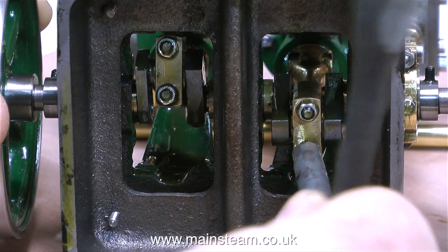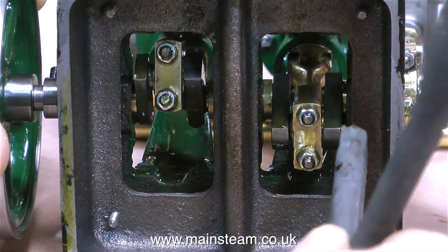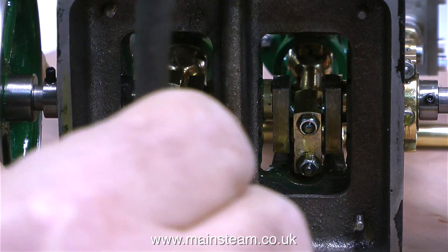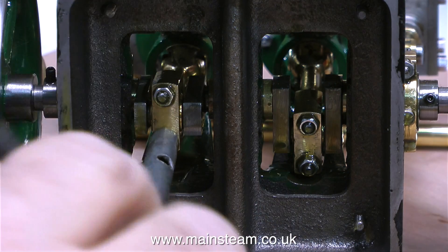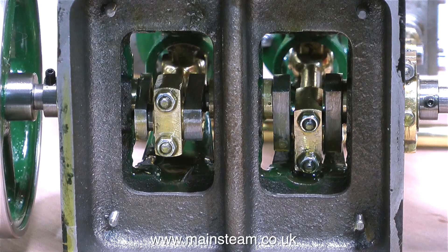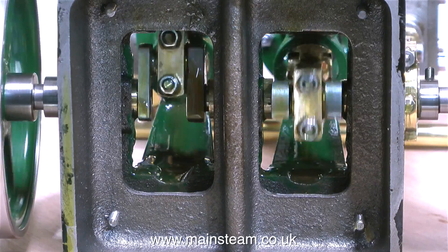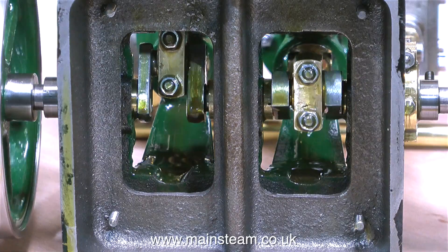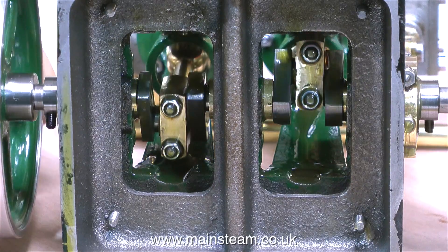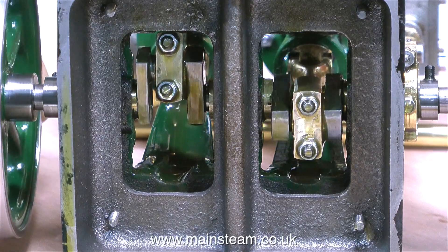The rest of this engine appears to be quite well made. If you look at the connecting rods, they're beautifully machined, the flywheel's well machined, and all the parts look good. But there's more to an engine than the way it looks externally. There is quite a bit of side play on the big ends on the crank pins, but this is not an issue because the big ends are not slapping against the crank webs. The thin crank web doesn't really need to be thin — it could be the normal size. But to be perfectly honest, I'm more concerned about the sound of the valve events.